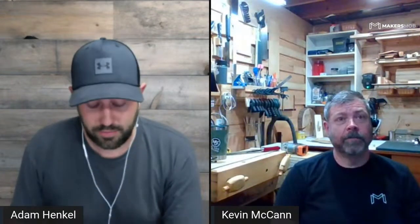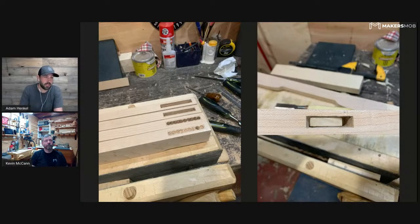Another way to do it — you could literally make your own version of that drill guide out of plywood: two pieces of wood at 90 degrees, clamp it on there, drill a hole through it and just follow that. That's a great beginner tip. This experience obviously helped you grow in your skill. Let's talk about your progression with using hand saws and some insight on the saws themselves.